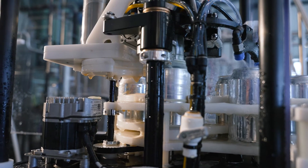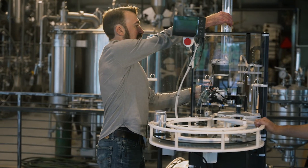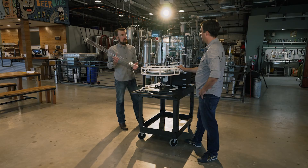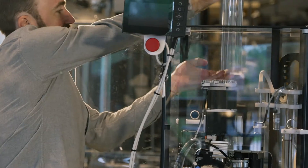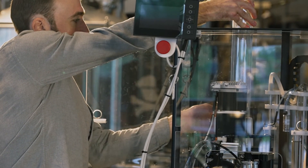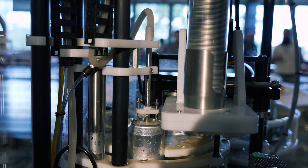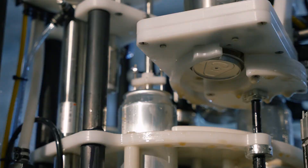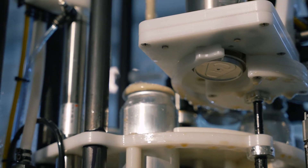Loading cans is a fairly straightforward operation. You just open the panel, remove the lid tube, install new lids, bring it back in, and drop that down back into the lid applicator. Hopefully you didn't even have to stop the machine — there's enough of a stack that stays in the lid applicator when you're ready to change ends that it should just keep cycling, and you never even slow the machine down for changing ends.